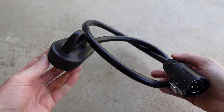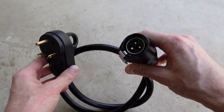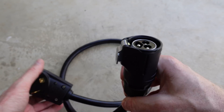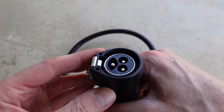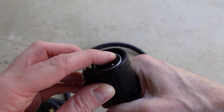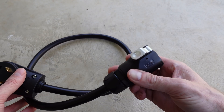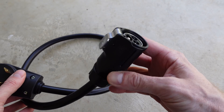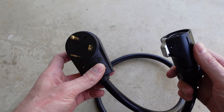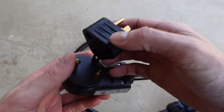Taking a look at the accessories this came with: here is the AC charging cable with a 30 amp plug on one end. I definitely recommend plugging the device end in first before plugging into the AC receptacle. The pins are recessed back a little in the connector, but it seems very easy to accidentally insert a finger in here. They're very nice solid connectors, but plug the device end first. They also provide a little adapter to convert to a standard 15 amp receptacle.